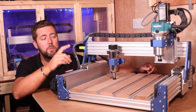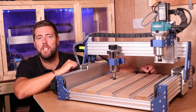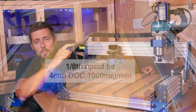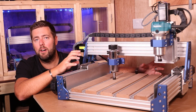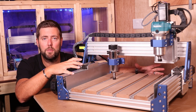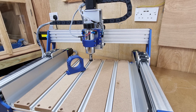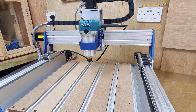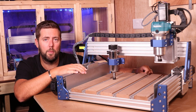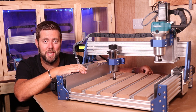Straight out of the box it comes with a 400 watt air-cooled spindle, and combined with this frame and stepper motors it can machine quite deep, as shown in these examples. The 52 millimeter holder will also take your average 44 millimeter diode laser, but with these motors and this frame you'll want to upgrade to something bigger. It also comes with a 65 millimeter holder, which will take your average trim router such as a Makita, Bosch, or Harbour Freight, and will also take some spindle VFD setups usually up to about 1.5 kilowatts. If you go that big with a spindle, you're going to breeze through any material.